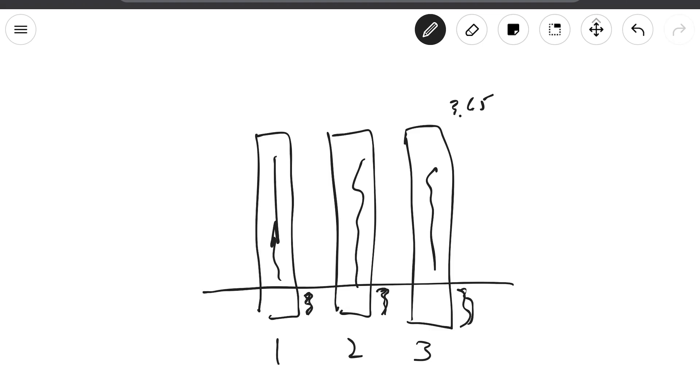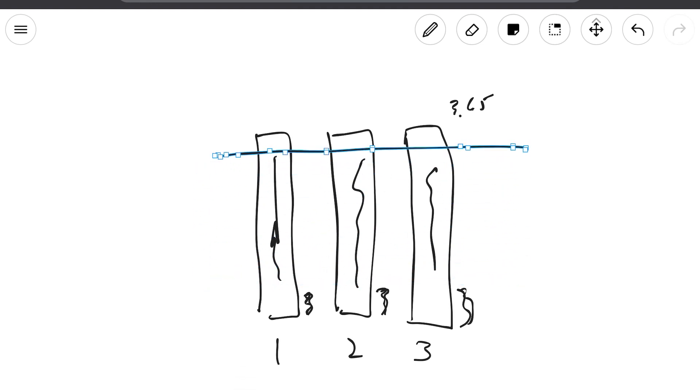Because basically when I go to discharge, let's say I've discharged them about 80%, well they've all lost the same amount of power and they all have very similar amounts of power left over. And recall that it's the amount of power that's in the battery that determines its charge. So they're both holding similar amounts of power, the same percentage for each of them, because they're the same capacity. They're really well balanced. So in an ideal setting, you don't need any balancer at all.